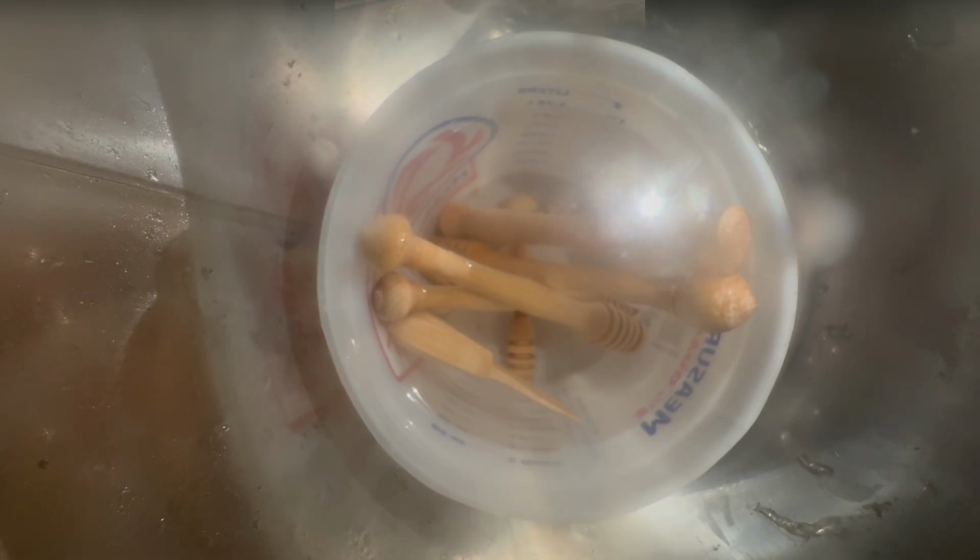What I'm hoping to see is the butter spreader I just made drop, because then I know it's full of oil. That's why those two honey dippers that are in there that have already gotten the vacuum treatment are just laying flat on the bottom. So I'm going to let this run while we cover the pressure pot, and then we'll be back to check on this, and then we'll call it.